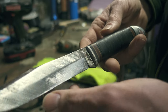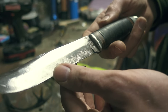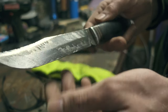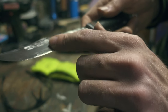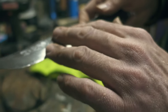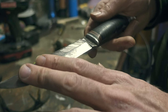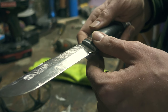Here's the result of just some simple sanding with the Dremel — whatever grit it might be, 60 or so. Here's the side I just did, and here's the undone side. Huge difference already. At this point, I'm going to finish doing the other side and then do it by hand. Probably start with like an 80 grit as well, get any scratches from the Dremel off, and then hand sand all the way up to a thousand. Then get back on the Dremel with a polishing wheel and this will be done for the blade. Next video will be the handle. Let's go to time-lapse.